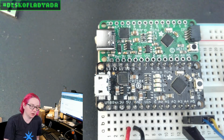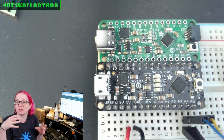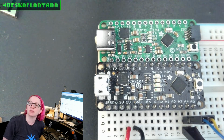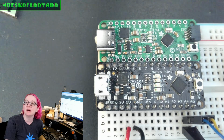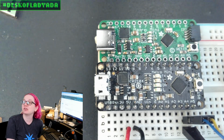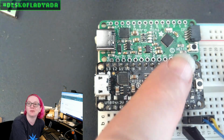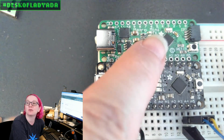And there's just one less ground pin. I mean, there's still ground, but you don't have 3 grounds. You have 2 ground pins or something. So it's otherwise pretty much the equivalent chip. It's just a 28 QFN instead of a 32 QFN. A lot of people don't use this package. They use this one. So this one I think was available.